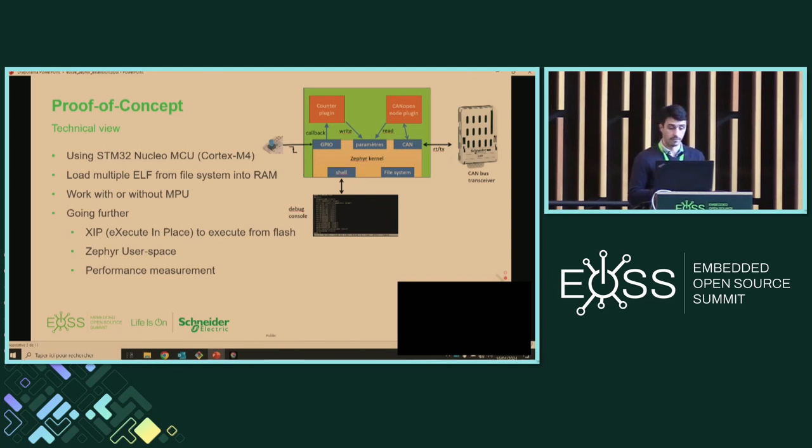and we plugged in the small blue button just to prove that if we press the button, we can have a callback on the GPIO and reset the counter. So with all of that, you can prove that first you have a product which doesn't have the CANopen stack, so there is no communication possible with the host on the CAN bus. You then load the two extensions, so your product now has the CANopen stack on it. So it was a runtime amendment. And then you can communicate with your host through the CAN bus.